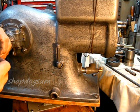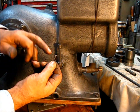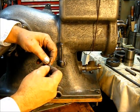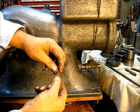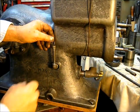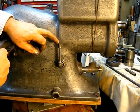The way you discourage that and still maintain the vent is you take a cotter pin and bend it. See how I already bent that cotter pin - this is a real little bitty one with a head on it, just enough to not fall through the hole. I cut it off and bent it with the needle nose. You squeeze that thing together, pull it apart so it'll have tension on it, then squeeze it together so both legs go in there and you push it down in there.